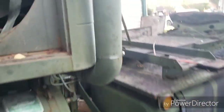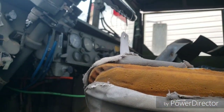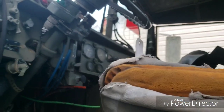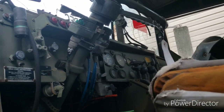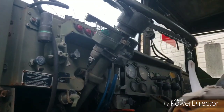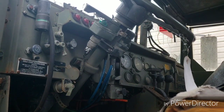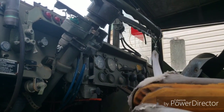We're going on a 939 series truck — this is a 932 AO non-rebuild truck. The condition is no-start, no power inside. Basically you turn both switches on and get no power at all to the gauges, no flicker, nothing. Your lights will still work, but first thing to do is make sure you've got 12 to 12.6 volts or better to each battery and 24 volts total.